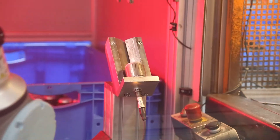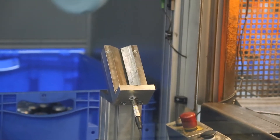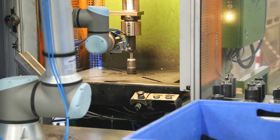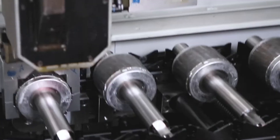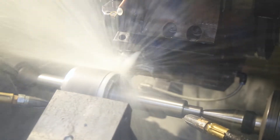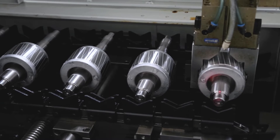The CNC manufactured rotor shafts are made of stainless steel, and our permanently hard-working employee Armin guides them into the press for a lifetime connection. The rotor unit is then fully automatically turned in the CNC machine and electronically measured.